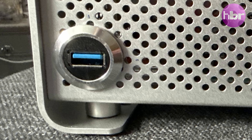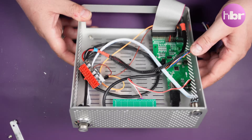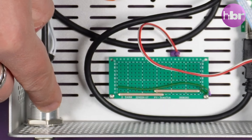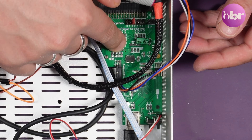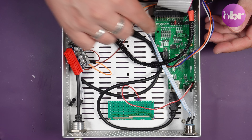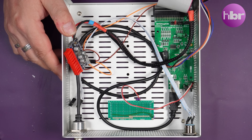Using a step drill and some careful marking, I created the hole and fitted the USB to the front of the case. It has a nice aluminium finish, which fits in with the case beautifully. The Gotek mounted using a combination of 3mm and 2mm standoffs and screws. The entire bottom of this case is slatted, and therefore very easy to mount these standoffs to.